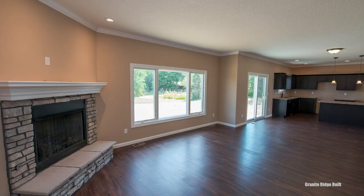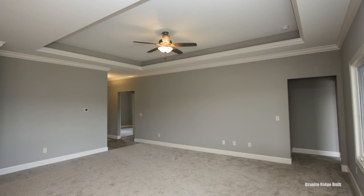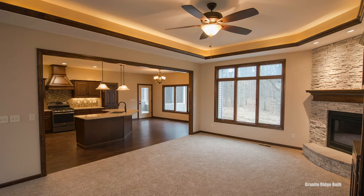But when we go back to talking about what it can do for a room, we talked about putting trim in areas of transition or corner pieces. So you've got the ceiling to the wall. That's where the crown typically ends up being applied, and it can do a lot for that empty box syndrome. It can make an 8-foot ceiling feel more like a 9-foot ceiling because it helps your eyes just roll from the wall surface to the ceiling surface. So it can do a lot for that room.